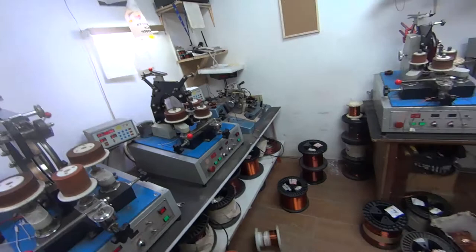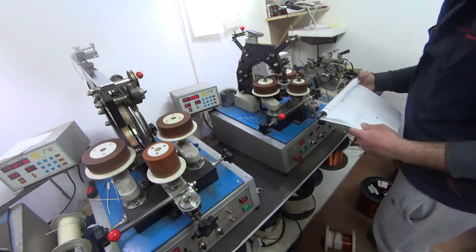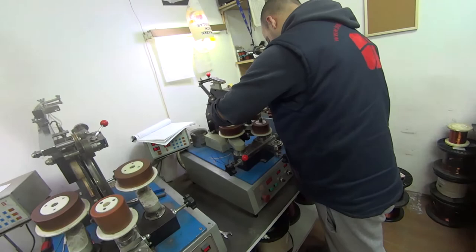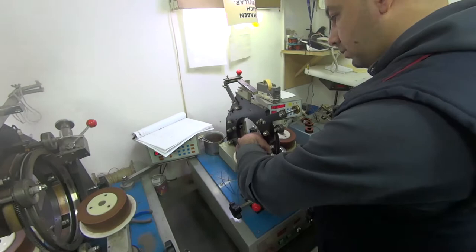Gets it threaded. One of the things you see around here is all kinds of different copper. Loads and loads of different kinds of copper for different types of use. Different types of transformers, power transformers, output transformers, chokes, interstage transformers, and different ones of all of those for every application. So you can imagine it gets fairly complex. You've got different cores and coppers for everything. Now the actual winding goes on the core after the tape is around the core. So you see it starts to get a nice look.